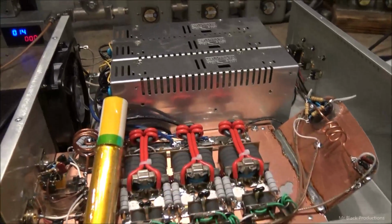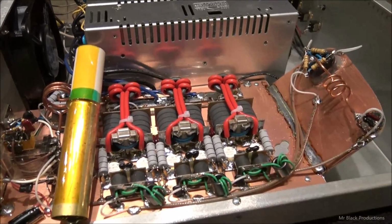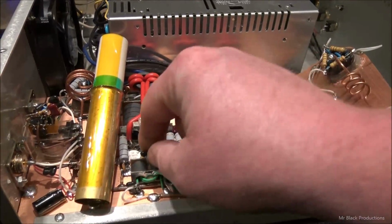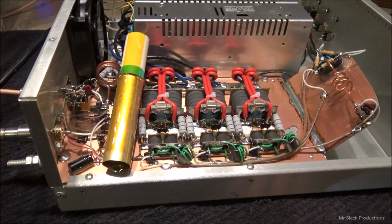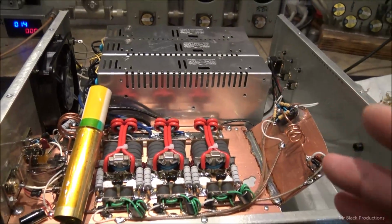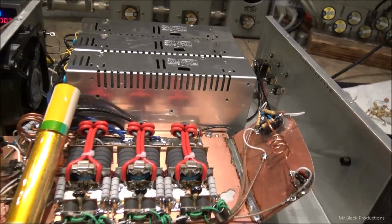So we got metal clads over the output transformers, the original old school Carl built style transformers. Good pill strips in it. The pill strips are still in good condition. Like I said, no Chinesium parts in this thing. They're all made with actual American old school stock. Input and output transformers have the right number of turns in them. The power supply internally is running at 15.8, and underneath full load it drops to 15.2.